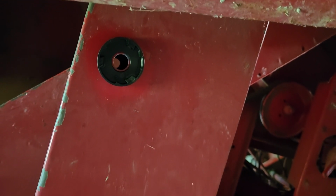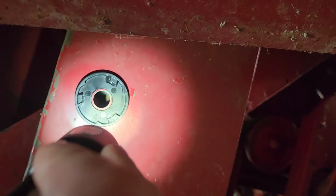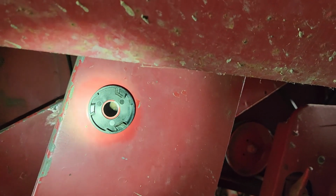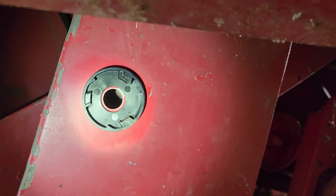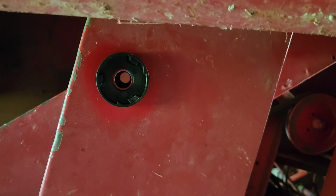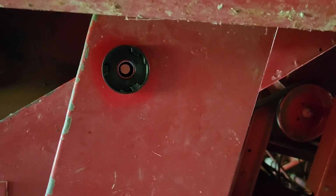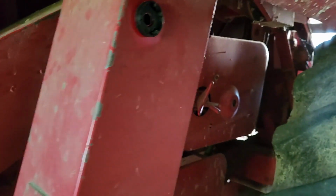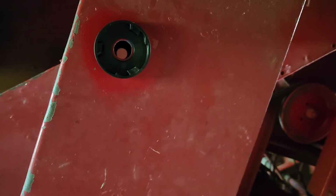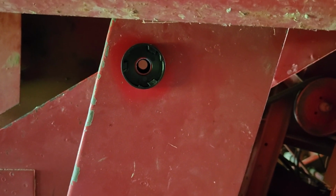One thing that we'll see how it works out, but I do have a little bit of a concern. See if I can get my flashlight on it here. If you look in there, that right there is your elevator chain. You can see across hole to hole, and I think it's pretty much straight back, but the drill chuck they give you is obviously a bit bigger in diameter than the rest of it, and the drill bit is just long enough that the drill chuck centers up across your elevator, which means the drill chuck is basically right next to, or into, that chain. It was at least touching it. Whether or not it was changing the position on the back side of the elevator, I don't know. Again, that was at 2 3/16 from this edge. So anybody else doing that, you might want to favor just a little bit further out.